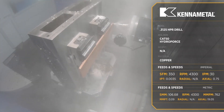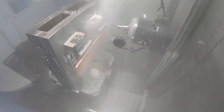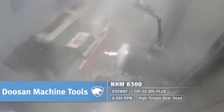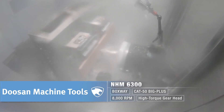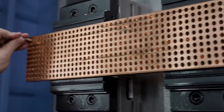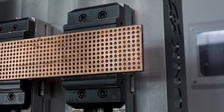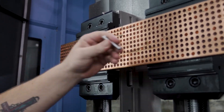We ordered some slightly undersized drills specifically for copper, so for a quarter-inch hole, I'd order maybe a 236 drill. The plan was to interpolate the holes to size afterward. The drill would drill like four holes on a bolt circle and they'd all measure like 238 diameter, then the fifth hole would completely blow out to like 260 diameter. There was no galling, no visible issues with the tool, just super inconsistent results. Jesse had the same issue in his parts, and there was really no rhyme or reason to it. In the end, we had to drill the hole way undersized and then interpolate them to size.